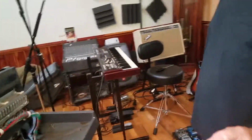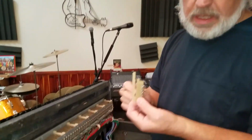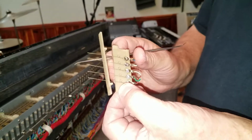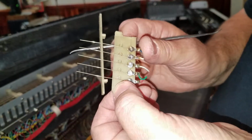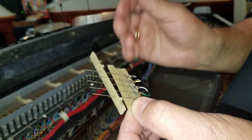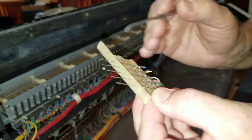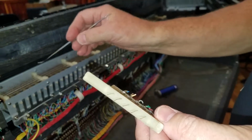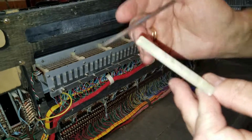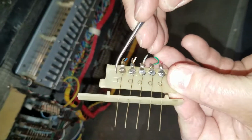Can you pause? Yep. Okay, so I have a contact here that's loose to show you how to adjust. This happens to be for a Super Continental. It has 5 contacts, but it'll work in a regular Continental. You just remove the lower contact. Now, in our case, it's an upper contact that's too far away from the ground bus bar. So we want to add more tension.